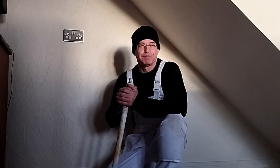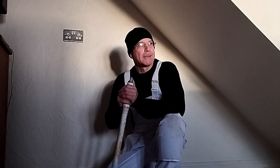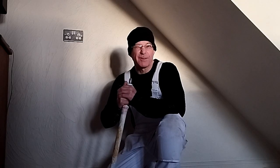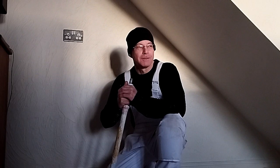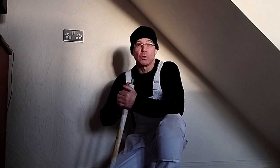Welcome back to Painting and Decorating. This is a cold room — 11 degrees in here. Even when you put the heat in, it just doesn't seem to heat up. The outside walls, just condensation. You put your paint on there and it just doesn't want to dry. So your only option is to force dry.